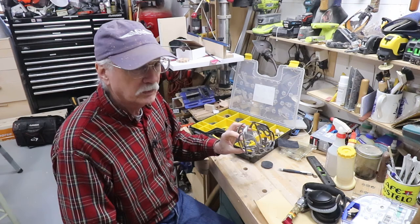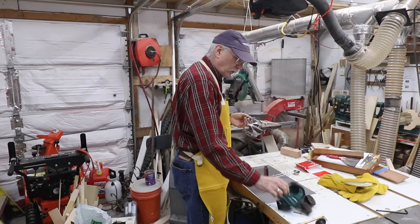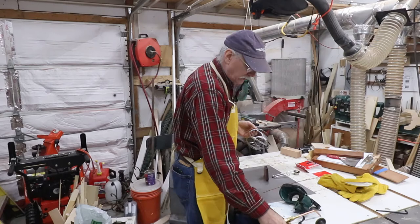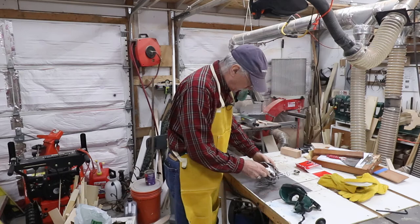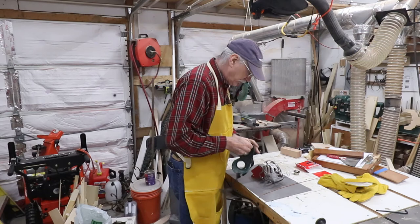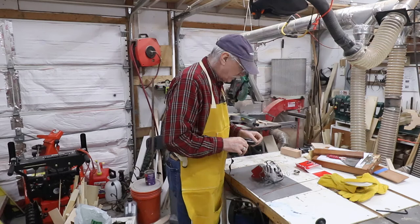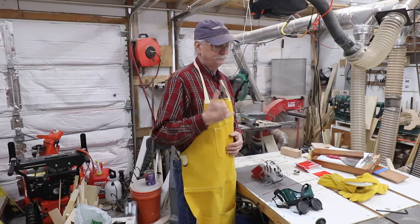I've got a little bit of a gap to fill where this broke. I'm going to use my gas welder and a piece of welding rod — I've got a medium-sized tip on here. This is oxy-acetylene welding. No reason to drag out the MIG welder for this. I've got a magnet to help me stand it up where I want it. I can get in and heat it from this side and burn the wire from this side. Goggles don't fit over my glasses, so I'm getting relatively close to the work. Just an apron to protect my shirt. How many of you guys out there do welding and have shirts with holes burned into them? It's a thing. Let's burn some wire over here.